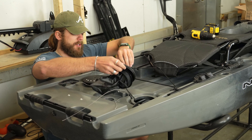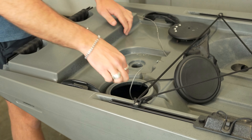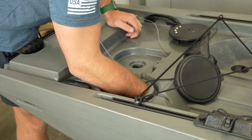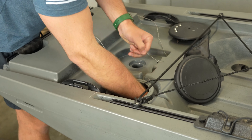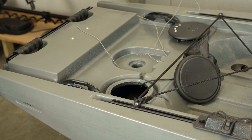If you haven't already, all you have to do now is take off your rubberized cap on your access plate, pull out your lift line, and then with your right hand go through that access hatch and take your spectra cord and thread it through the other pass-through. Once you've done that, we are almost done installing our lift line.